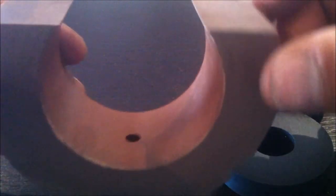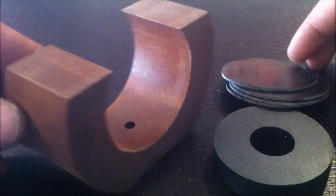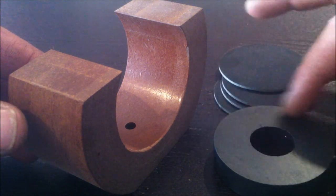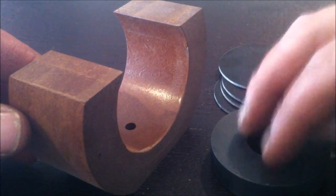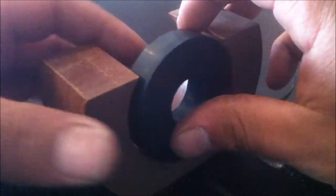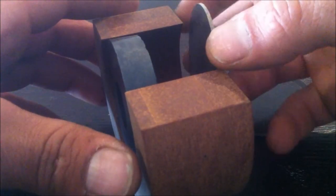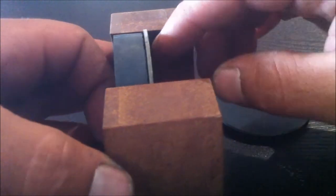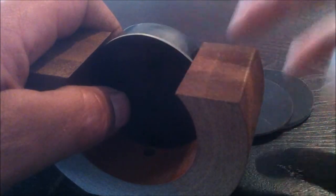Now, if you've been watching my channel for a while, you might remember I was talking about building a magnetically quenched spark gap. That idea sort of went straight to the can once I did a bit more experimenting and realized that the stronger the dielectric field that you're putting through the electrodes, the stronger the magnetic field that's required to quench that. So it's not really going to work with high power stuff, so I sort of canned that idea, but I definitely still want to build it because they will come in useful for smaller sensitive field strength meters and detectors connected to receiving coils and things like that.